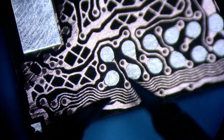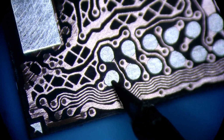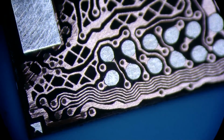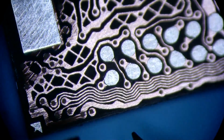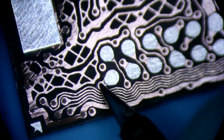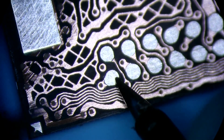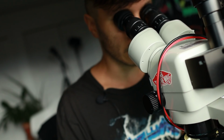If we needed to communicate with a NAND protocol directly, we would definitely want this pad to be connected, because then we can use a quick pressure adapter to make this connection for us on the fly. We wouldn't have to wire it. But if we were gonna wire it, we could just use this via hole right there, run the wire directly to it, and not even worry about this pad. So that's point A to point B. And we're gonna just go ahead and test them all.